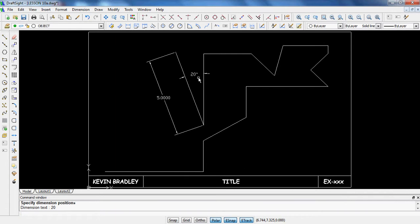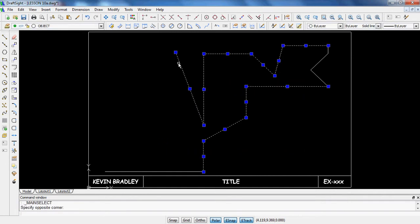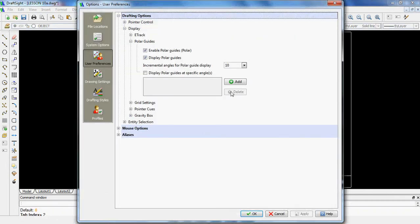Okay, so there's a few of these where you are going to have to make those changes to make sure that that works out the way that you want it to. So that should help you finish up 11A, and now I'm going to go ahead and go into 11B. So 11B just gets into isometric drawings. If you remember from the first semester, we only used our 30-degree triangle, and so everything was either like 30 or 90 degrees. So I'm going to go ahead and change my polar angle to 30 degrees.